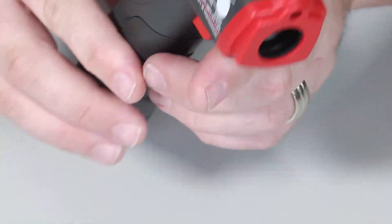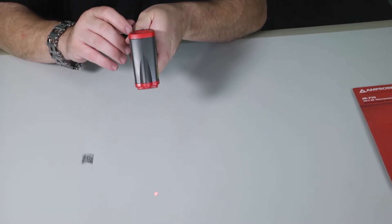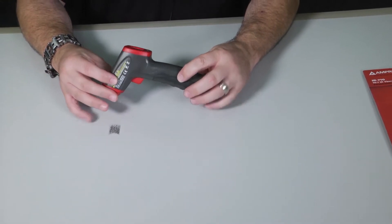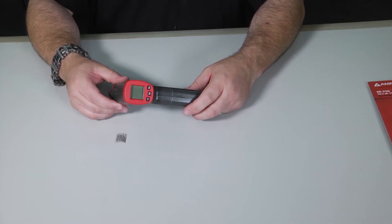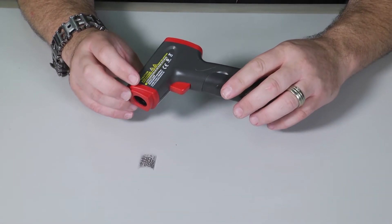What I tend to do is start with my measurement and scan slowly across to see the rise — as I see the rise, I can record changes. I use these all the time; I keep the same model in my tool bag so that when I'm in a home and the unit's just been fixed and turned back on, I can quickly shoot a return, shoot near a supply, and see that it's starting to blow cold air and know that it's functioning. But I'm not going to use it to record an actual split.